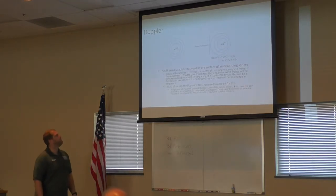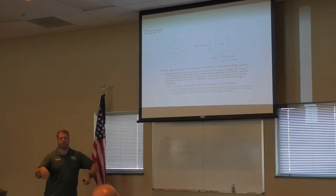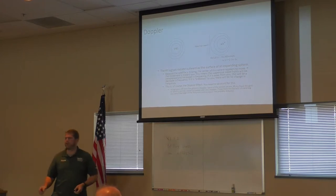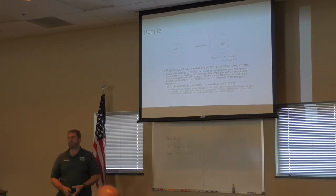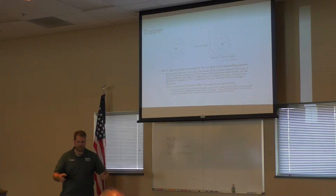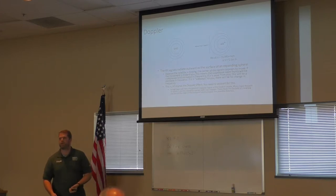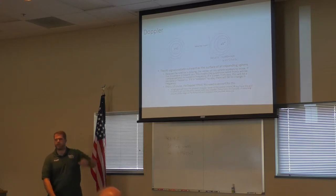Okay. So radio waves generally just go out on the surface of a sphere. And this is back to that weird equation I showed with the R squared factor in it. If you thought about how much paint you'd need to, say, paint a golf ball, right? Maybe a little thimbleful or something, right? If I made that golf ball 10 times bigger this way, now it's kind of like a big beach ball or something. Would I need 10 thimbles? I'd need way more than 10 thimbles, probably like 100 thimbles, right? Because these radio waves go out in all directions, and they go out on the surface of these spheres, basically,